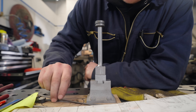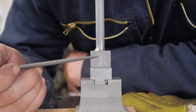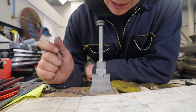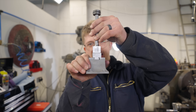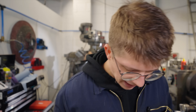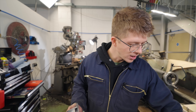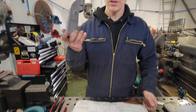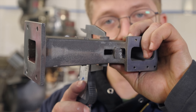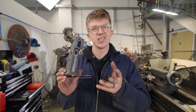So the ram is done. I deviated a little bit from the drawing, because the drawing specs out necking down this die area even more, but then you end up with a really small die and a big discrepancy between top and bottom die. I preferred the aesthetics of this and the idea of these things being closer to the same size. In an ideal world, I would have spotted that earlier and made them actually match. Anyway, there is one thing I know I've missed: I need to bring the distance between the faces on these bosses to the right size. I also missed that measurement callout when I first looked at the drawing, and I'm going to sandblast the whole thing so it looks nice.